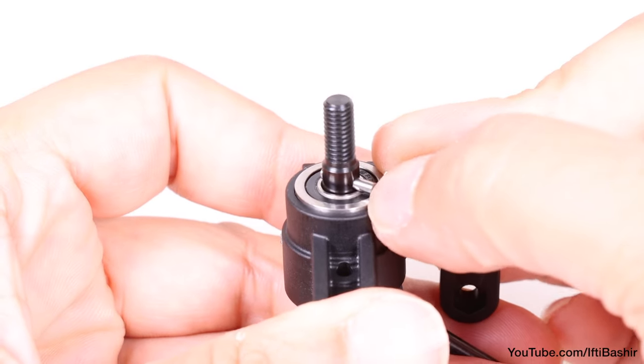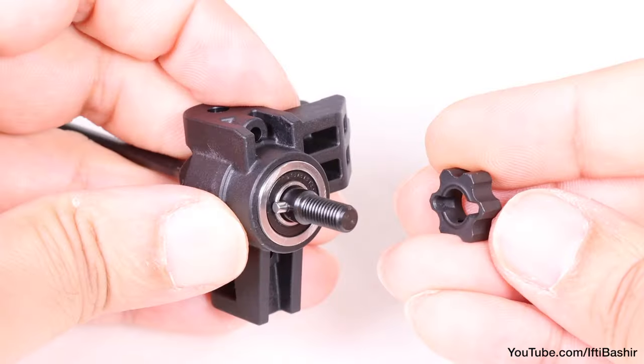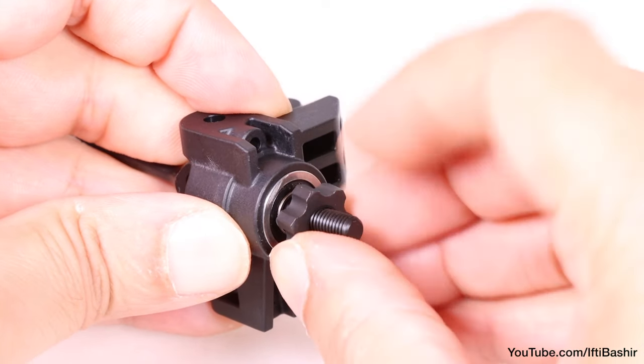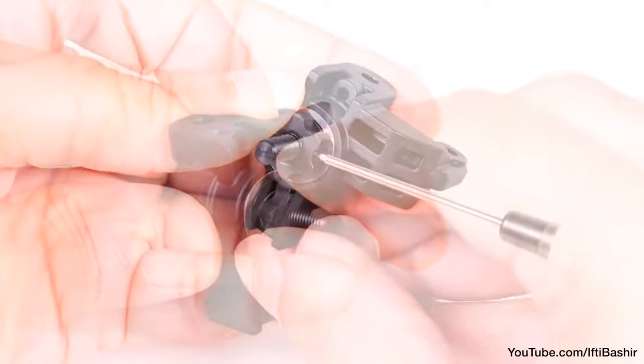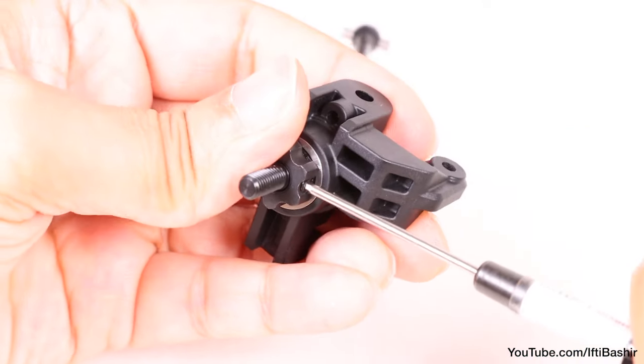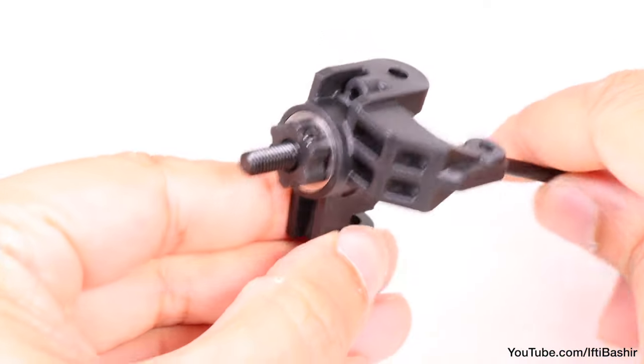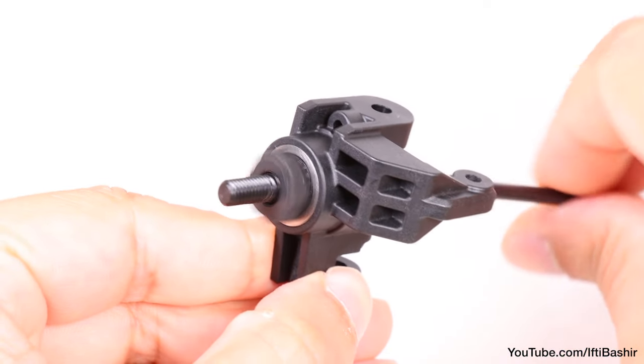After which we can drop in a retaining pin and cover with a 17mm wheel hex, again making sure the pin fits into the groove. Before inserting a 3mm set screw to lock into place — remember to apply some thread lock to the set screw and tighten down only until snug.